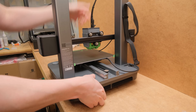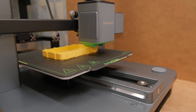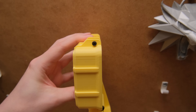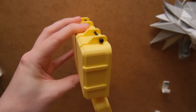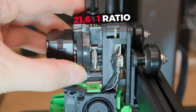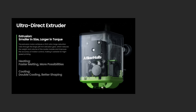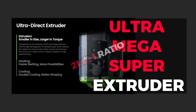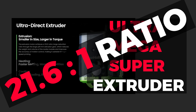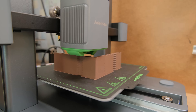All this started when Anker sent this M5C to check out. The build quality was nice but I couldn't say the same about the prints, as those were plagued with ghosting artifacts. However, it had something very unique: a 21.6 to 1 ratio extruder with big filament drive gears. At first that seemed just like a marketing trick — because bigger number equals more better, right? But flow rates were great, so I thought why not test how it performs when an extruder is pushed to the limit?